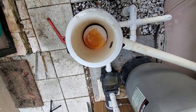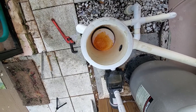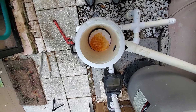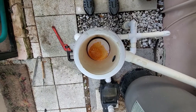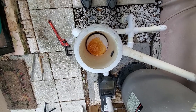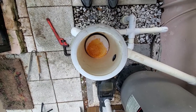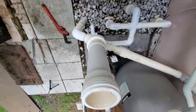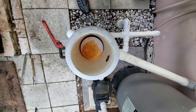After about an hour, if you open this up and the red dye is almost clear, that means it's working and chlorinating at a specific rate. You really shouldn't see the dye coming out of the supply nozzles — if you did, you'd be putting a whole bunch of chlorine in the pool at once. There's a very small pressure difference driving the flow. That's how you can determine whether it's doing its job. You can use any color as long as you can see it in daylight.